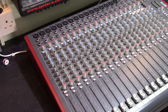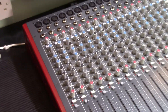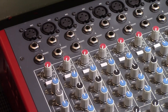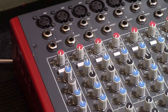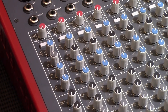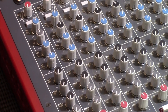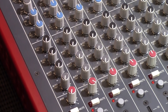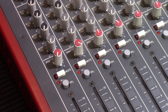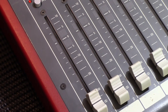Let's have a look at the desk a little bit more closely. Each of the mono channels has a mic and a line input and an insert. There's a gain that goes from minus 10 to plus 26 dB. Three-band EQ with a sweepable mid-range. AUX1 and AUX2 are pre-fader and AUX3 and AUX4 are post-fader, with pan left and right, mute, pre-fade listen, and full 100mm sliders.